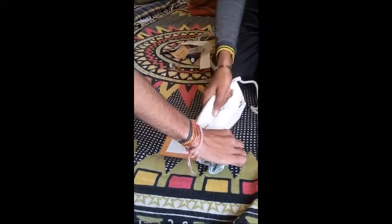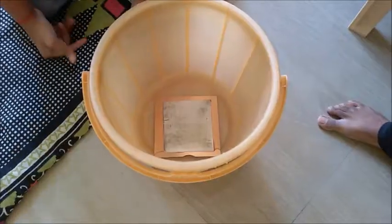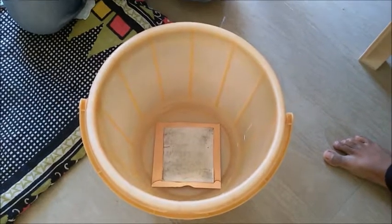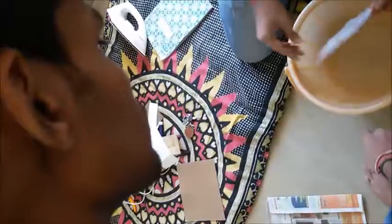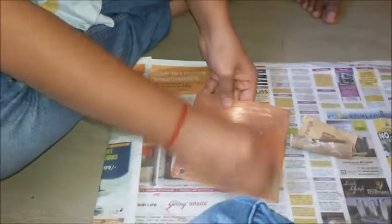Next, get warm water and place the PCB board with the printed layout into the water so the paper can be removed. If you see bubbles or the paper does not come off cleanly, the impression may not be good and you should repeat the procedure from step 1.